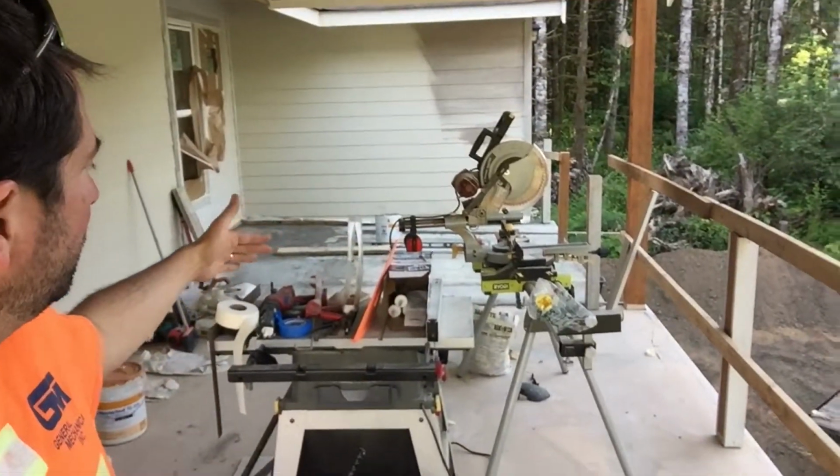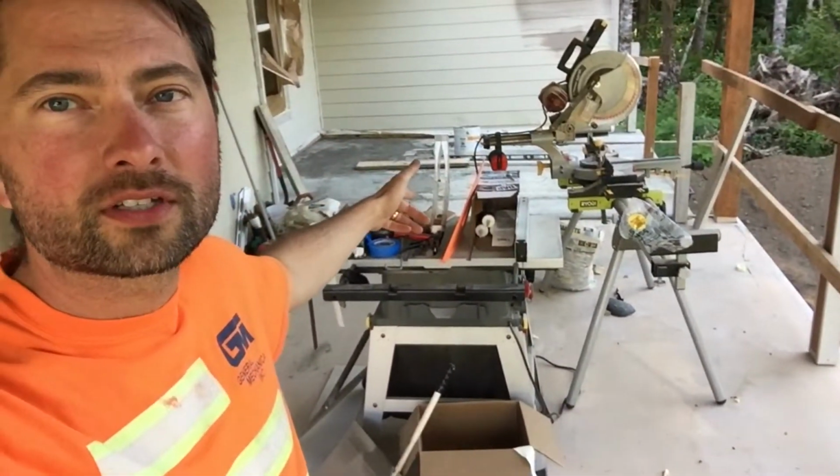A lot of shower installers use something called Schluter. It's the same thing, polystyrene foam with their waterproof membrane laminated to it. So that's basically what we're gonna do. Put the foam down, use Schluter Ditra on top of that, waterproof the edges and where they join up together with Schluter Kerdi, and we're gonna start from where the concrete stops all the way to the edge. Then we're gonna tile out here, and so we'll keep you posted how it goes.